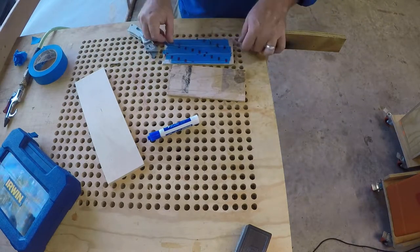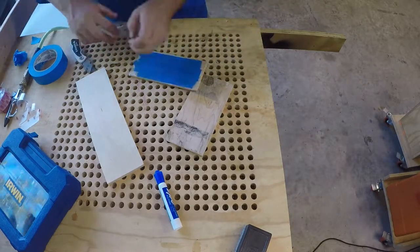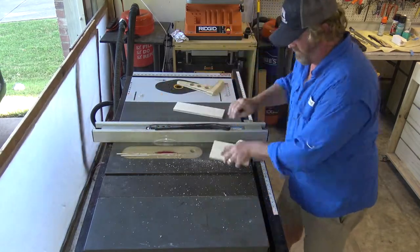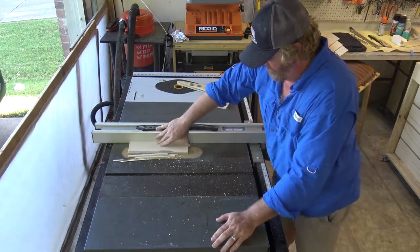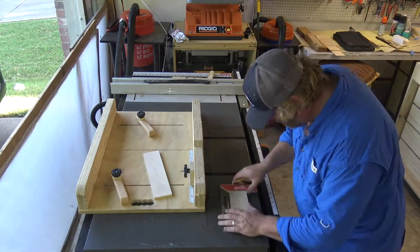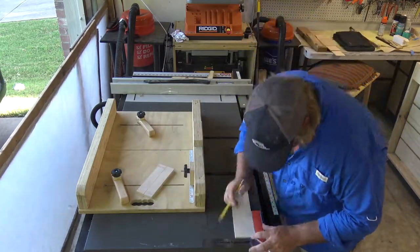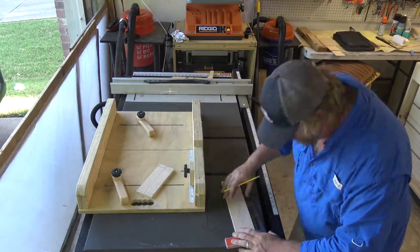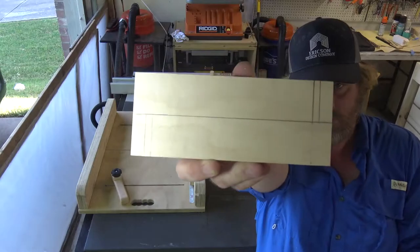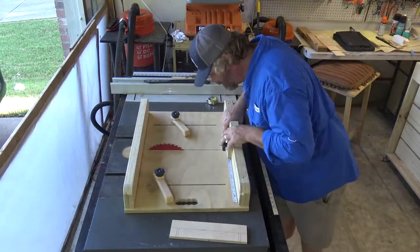It's a gummy tape so it actually gums up the saw a bit, but it's all I had and it'll work. Now that they're glued up together I'm going to slice them at three and an eighth and then three and a quarter so that everything is the same size. Next I'm going to take the cross-cut sled and notch out the actual groove — just a half inch over on the sides, a quarter inch thick, and one inch over on the back, a quarter inch thick by one and a half. I'll line it up with the saw blade and gently pass it through.